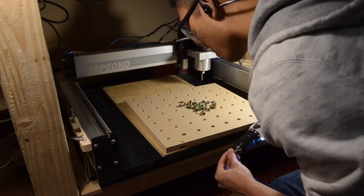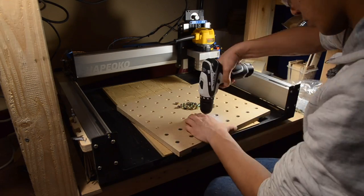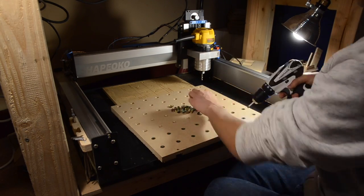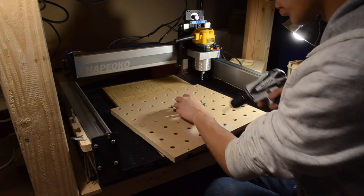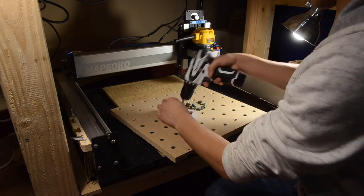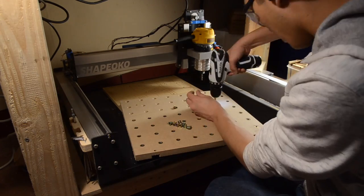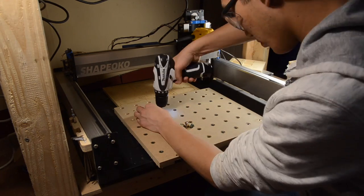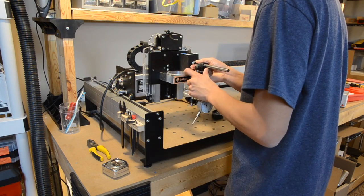That being said, a little effort on your part can go a long way towards improving the quality of your cuts on the Shapeoko. Here are the steps I took, and this is by no means a comprehensive guide to machine calibration. I consider my attention to detail to be above average at best, but you can absolutely be way more fanatical in the squaring of your machine. The only thing you'll need if you don't have one already is a dial indicator, preferably with a magnetic base.